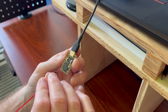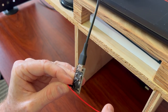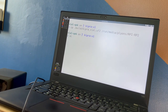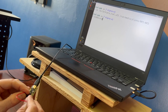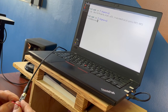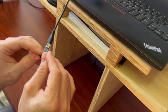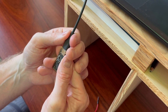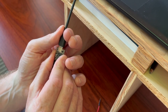And if we put this jumper wire in the second to last hole on the left side and then touch some of the holes on the right side, it'll type. So there's X, C, B. So it's working as a keyboard, and if I move this to a different hole, I'll get different letters. There's S, D, G, S. So now we know that it's working, and it's all flashed. So if we build our keyboard right, we'll be able to use it and be good to go.